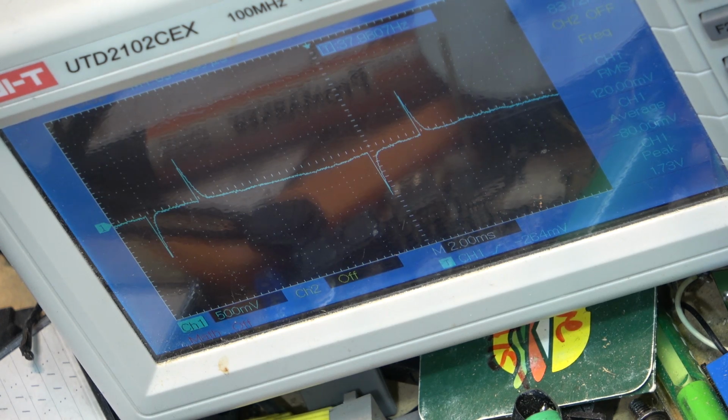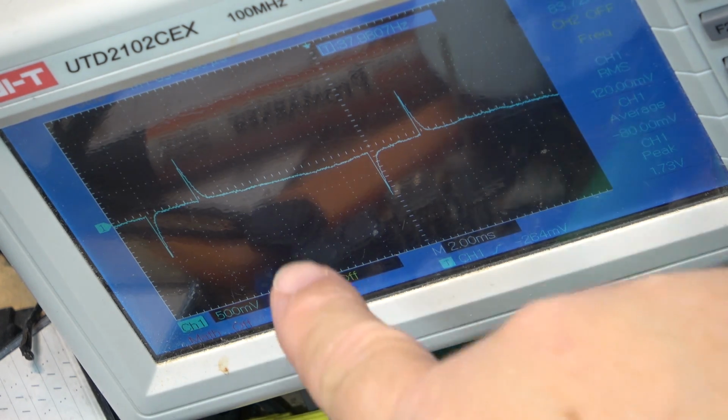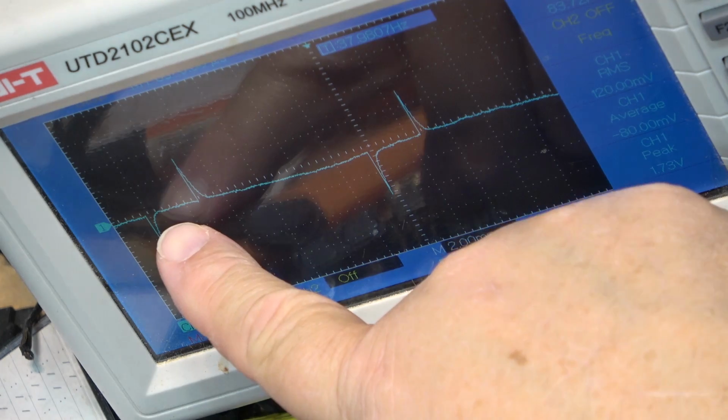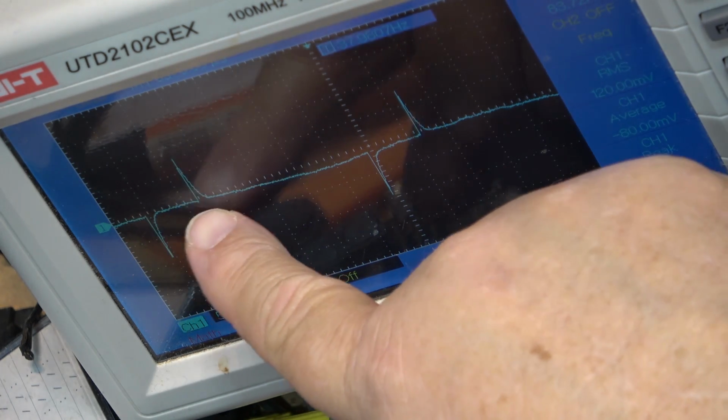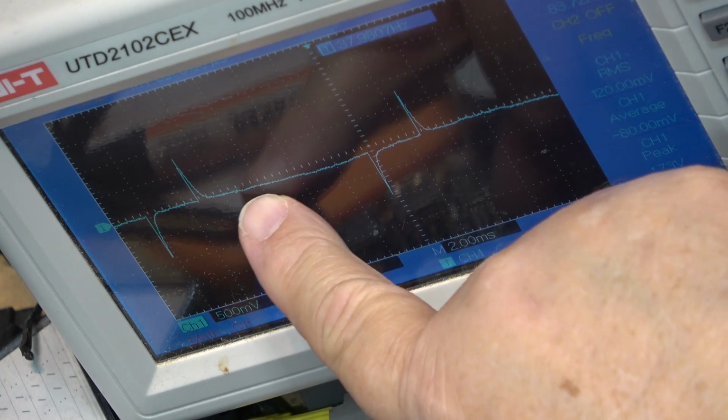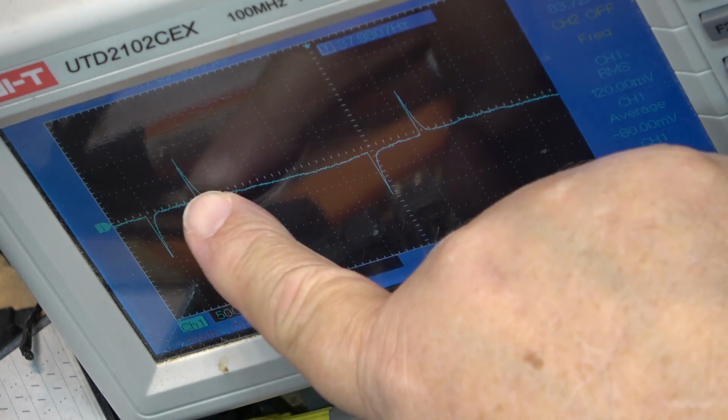So the longer the cable, so when it detects the signal coming back, there's nothing coming back now because it's on the scope probe and it's showing it as 0 feet. But when it's measuring the cable, a reflection will come back, and that reflection, depending on where it is in here, will determine how far it is away.